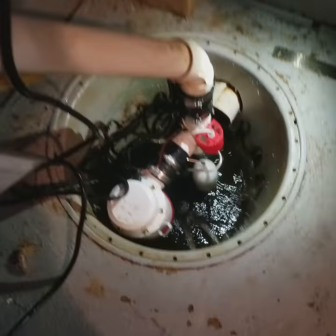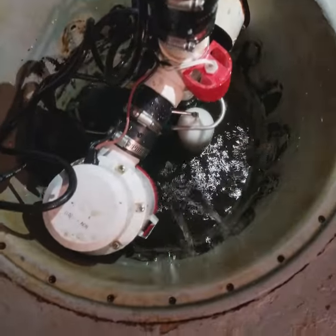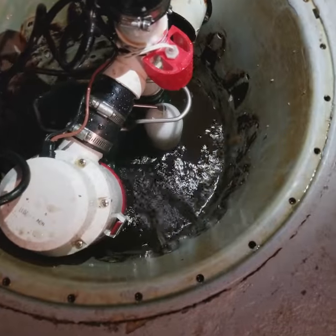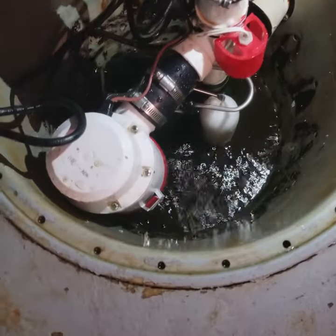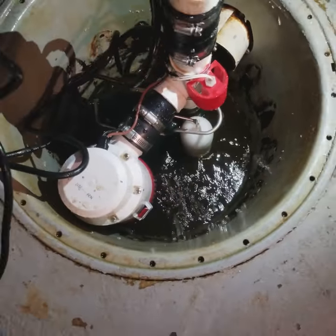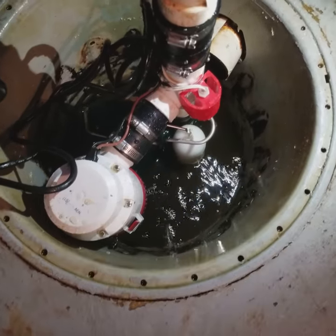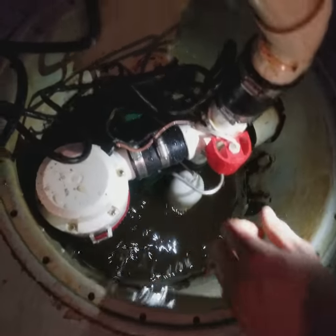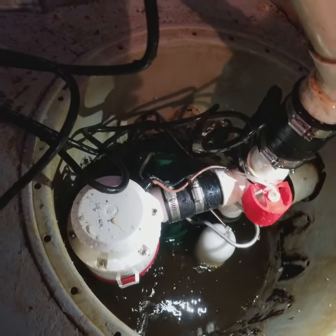And what's that, besides to make everybody wet, what's that do? It's a pressure release. Look at the holes. Look at that. Wow. That's what they're for. Looks a lot better, doesn't it? Yes. Oh, so it's a pressure release, so the stuff doesn't get... Yeah, you have one on the check valve, one on the pump, and you also have another one on your battery backup. So if they get clogged, the pump's not going to pump to full capacity.